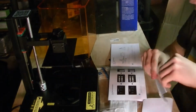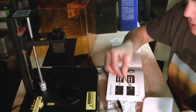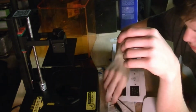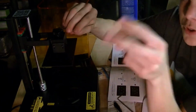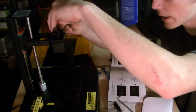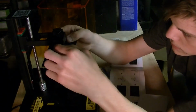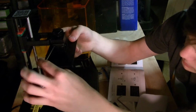And so we open our bag of screws, and it looks like take some of the included Allen wrenches. Well, actually we have to go and home the Z-axis first after we loosen the screws up here. The Allen wrench set comes with 3 Allen wrenches: small, medium, and large. The medium one seems to loosen the screws on the side. Just be sure not to loosen them too far. We don't want this to drop. Some of these screws are loose and some of them are tight. Some of them seem like they have Loctite and some of them, not so much.